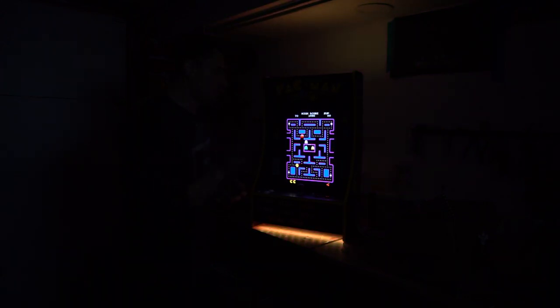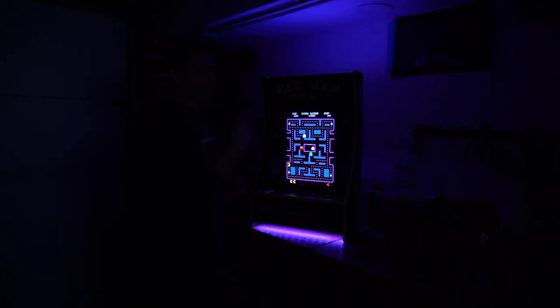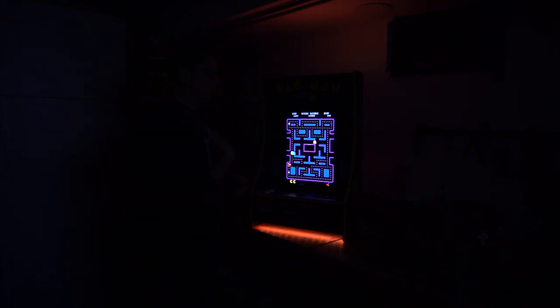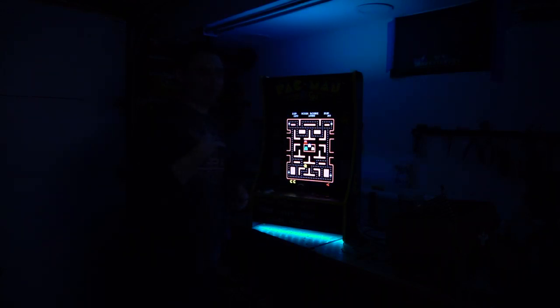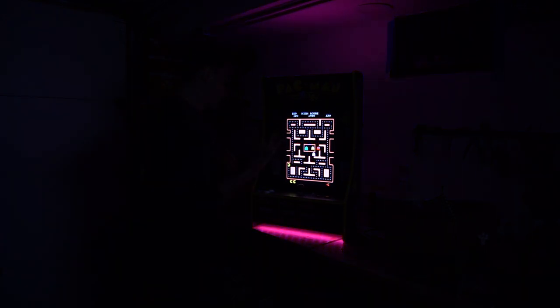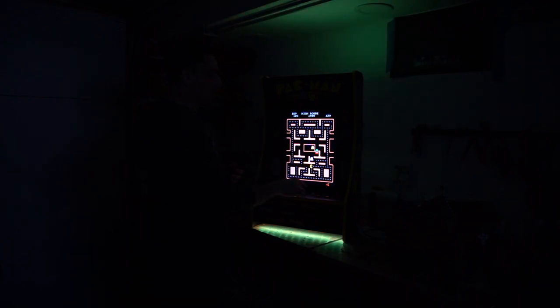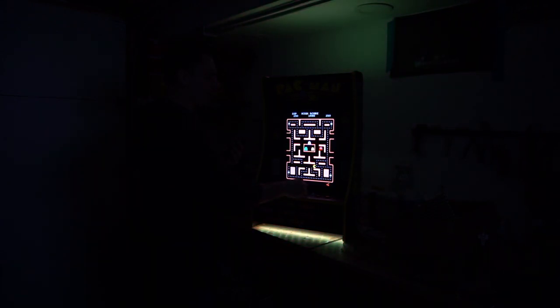Other thing that people don't really realize is that in these 16-in-1 boards, you do go into the dip switch. You activate this kind of test mode or settings mode, and each game has its own settings. The one thing that annoys the hell out of me is that the stock settings on these are just annoying because I always have to go in, for example, Pac-Man. Pac-Man always starts with 5 lives. I don't know why, but you have to change the dip switch setting to do 3 lives. That's how I grew up playing Pac-Man. Same thing with Galaga, you get the free life after like 18K or something like that. Dig Dug, same thing. It's about how many lives you get and such. But all in all, solid stuff.